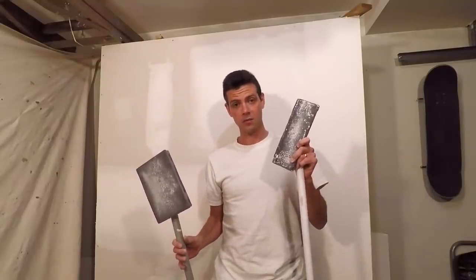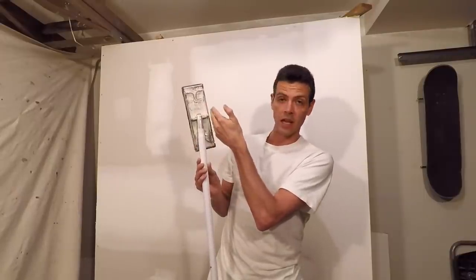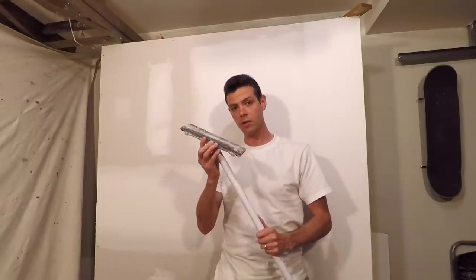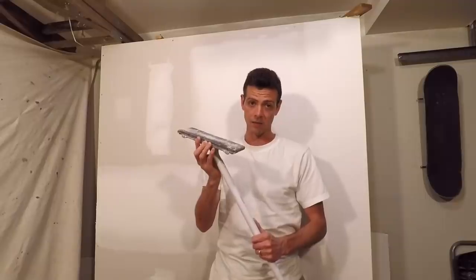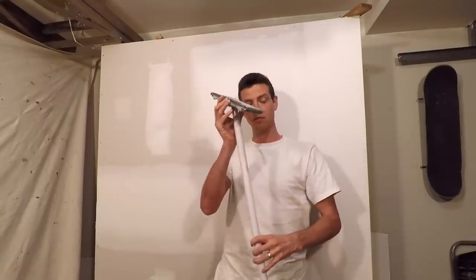The fact that the feathered edges even out makes me prefer this one — and I'm most familiar with it. The narrowness also makes it nice for getting into corners because your control is not far away from the edges of the pole, so you just have more control overall. Out of all of them, this is the one that leaves the flattest finish. Because it's narrow, it doesn't miss voids — it seems to find its way into everything and flatten everything out the best.